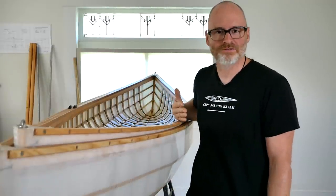With an increase in the efficiency of that sail shape over time, combined with a little less volume here and a slightly more efficient sail, I'm starting to get into the zone where I can pop up the sail and not be frustrated. Also, with these boats having a little more bite on the water, the leeboard system that I wasn't all that stoked on in the last video seemed to work a lot better. I actually got much better upwind performance — I was able to climb to windward, not well, but slightly, whereas the others were pretty much a wash on a dead beam reach.